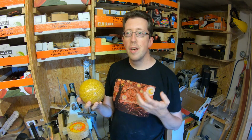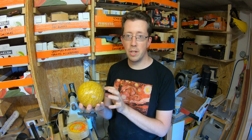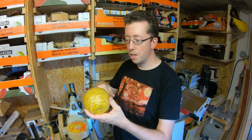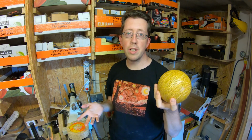What I did was put them in the chuck, and my thinking was to actually turn the part that's outside the chuck sphere-shaped. But if you remove too much material and then rechuck it, in theory and taking it to the extreme, you'd thin that down, then turn it around. You'd have to thin down along there, and so on. You'd turn away the whole material without ever getting a sphere. So only take off the high spots.